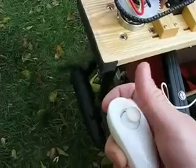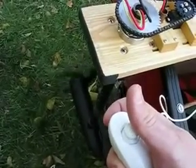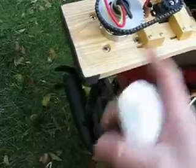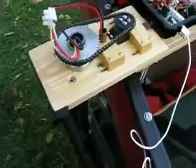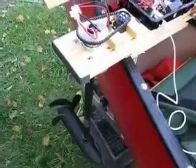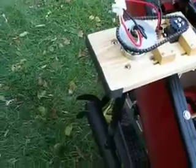What this does is drive the port and starboard motors relative to each other — one side goes one way and the other goes the opposing direction — to spin the boat around more tightly. This tractor drive, adjusting the speeds of the two sides relative to each other, basically only works when the boat's going slowly. Once you're up to cruising speed, around three or four miles an hour, that stops working and you want to be ruddering those motors instead.